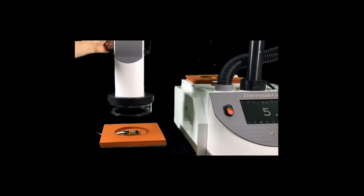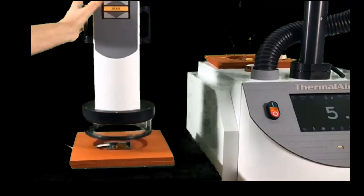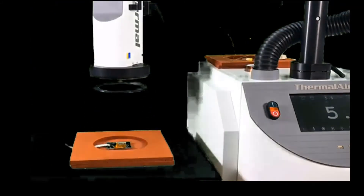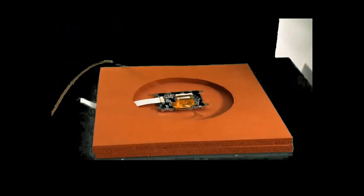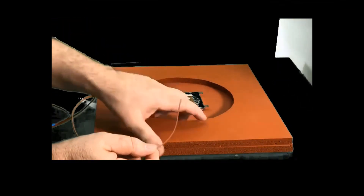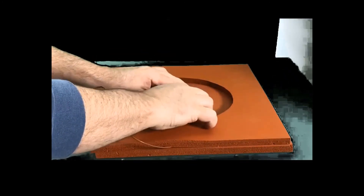The glass cap comes down over the device and then you can bring the device to hot and cold temperatures using the air sensor. There's another mode — DUT sensor mode — where you can actually use an external DUT sensor to control the case of a device, a unit that you want to test at temperature.